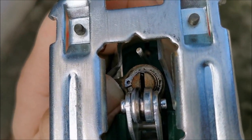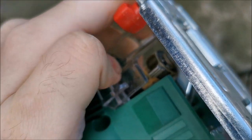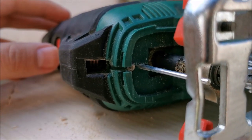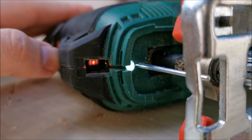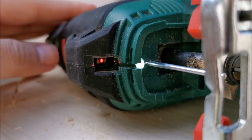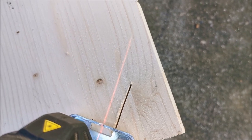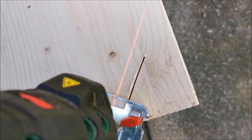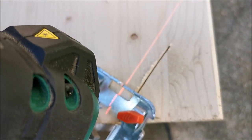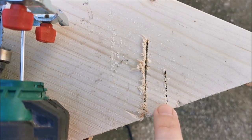There's a small issue: you cannot change the blade with the guard on because it hits the plastic and you can't push the blade far enough. So the guard needs to come off when changing blades — that's a downside. About the LED and laser: press once for both LED and laser, press again for LED only, then laser only, then off. The laser line is really really nice — you can follow a line extremely easily even in normal daylight without direct sun.